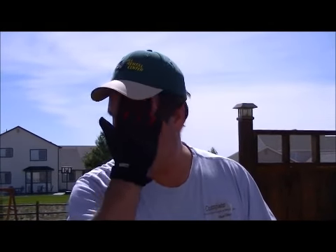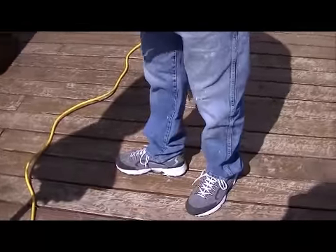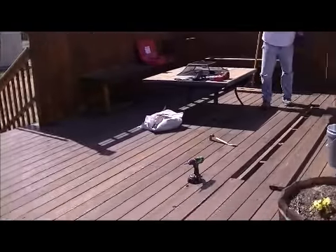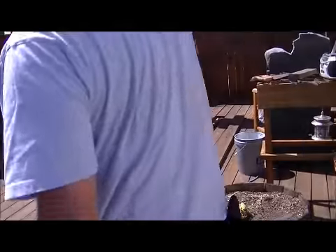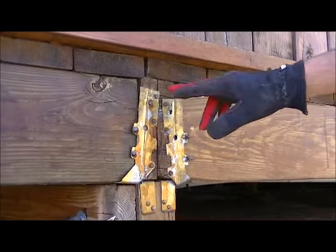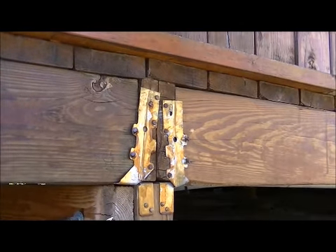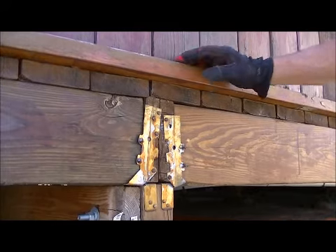We're back here doing the second beam — we've already done the first one. This is to show how it turned out. You can see after it's all put back on you can't even tell it was raised, because I'm walking on where we had to shave the beam down. We've already put it back together. Now we're over here going to do this one. We've already started taking off the decking, and you can see how it's farther apart and also raised slightly right here. This is the beam, here's the joist, there's the decking — the beam is higher than the joist and it's pyramiding this. This is a privacy fence on the deck so we're going to cut the screws so we can pull these out and shave that off.